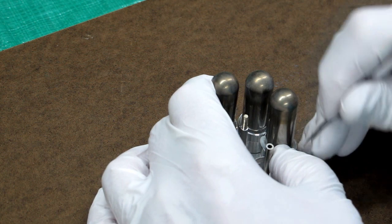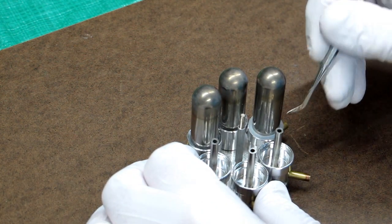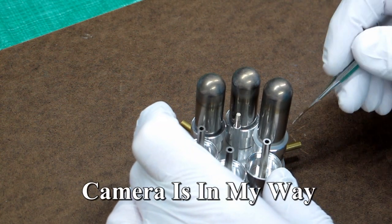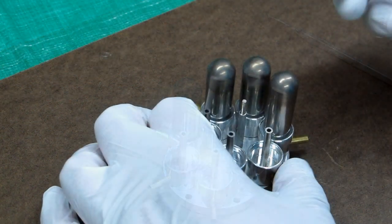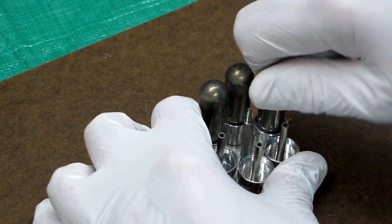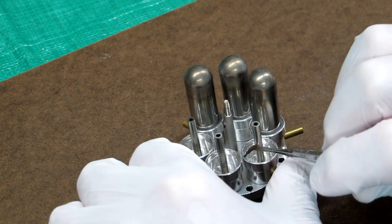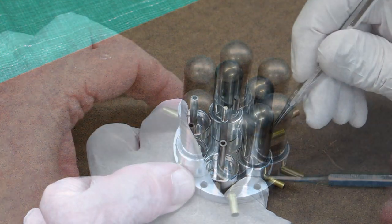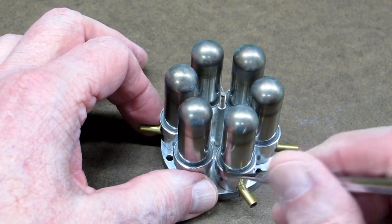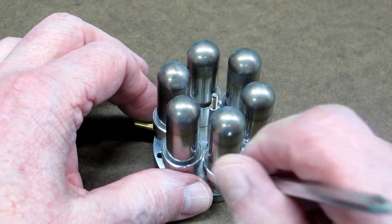So every 90 degrees you push it down in there. The reason for that - you push it down on this side, push it here and then on the other two sides, and a little bit of that will be bowed up. That o-ring is trying to stretch, so you've got to compress it and push it down in there again. I push that down and it's all down below the surface. I wiggle this around and turn it a little bit, then go around and make sure it's still down as far as it can go - it has to go up against this groove on the inside. The reason for pushing it in on the four corners is that the o-ring, if you don't, will try to stretch. As you work yourself around you're going to have a big loop of o-ring sticking out, so you've got to put it in on the four corners and gradually start working it in.